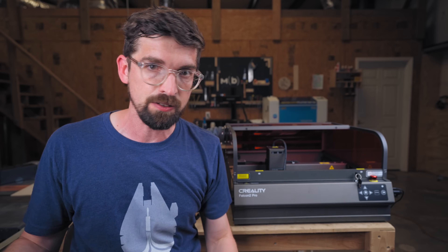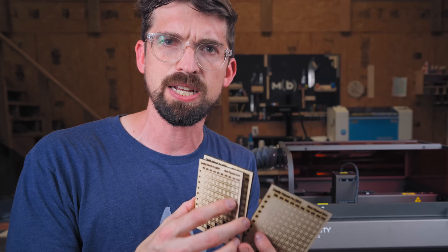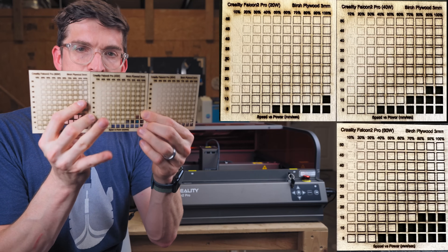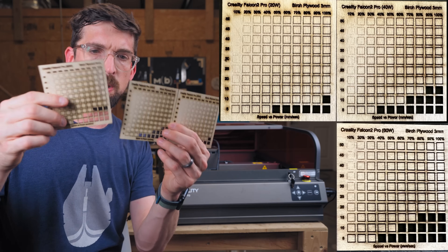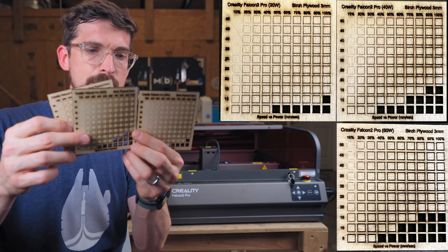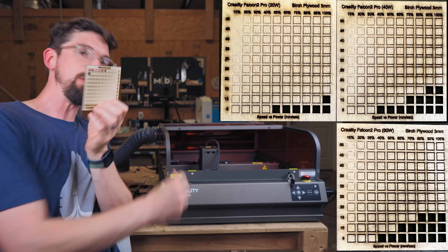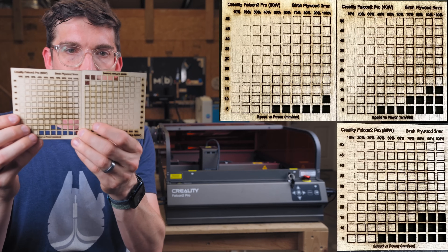Unlike a CO2 machine where you can't easily change wattage, as you turn on more laser diodes you introduce more internal optics, which gives you a thicker laser beam — more power, but less precision. So for engraving you probably don't want 60 watts, as the line will be thicker than you want, but for cutting 60 watts is great because you can cut faster and thicker. In the cutting test picture you can see results going from 60 down to 40 down to 22 watts, and there's a pretty big difference in line thickness between the extremes.